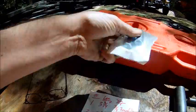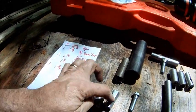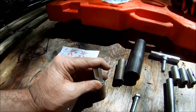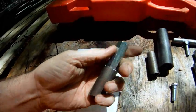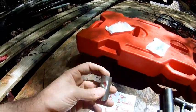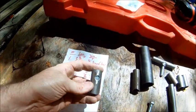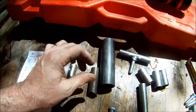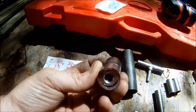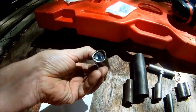You'll need one of those for each of these handles you're going to make. First thing you need to do is take this coupling and put it in the short length of tubing. It may slide in there easily or it may be a tight fit. The coupling is inside that piece of tubing, and you'll see that the flat side is in that hole window. What you're going to do is plug weld that coupling inside of that. When you're done, it should look like this — there's the plug weld right there. On mine, it's almost flush with the bottom.